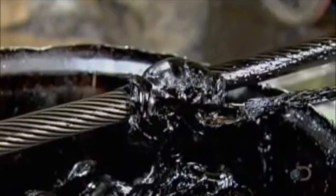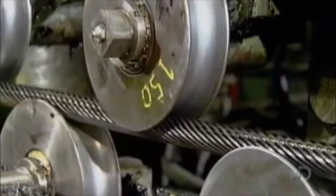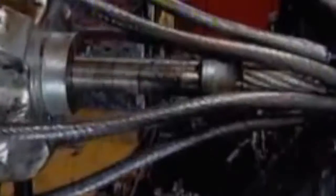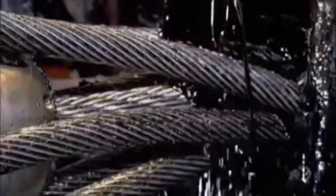Lubrication is critical. It also penetrates within the wires. The strand exits the machine coated in lubricant. The strand passes through a row of straightening dies. The strands are then twisted together over a core, which is itself a small strand.